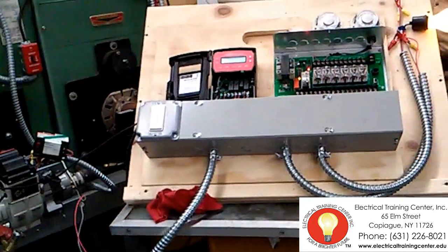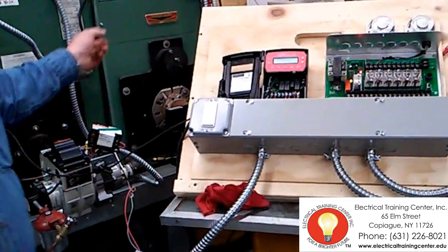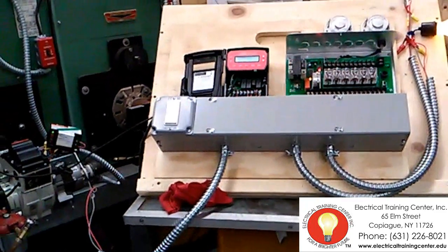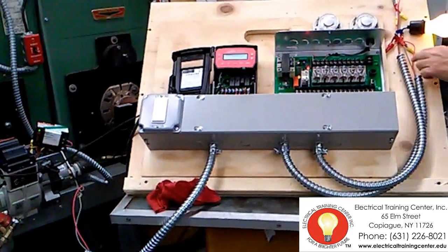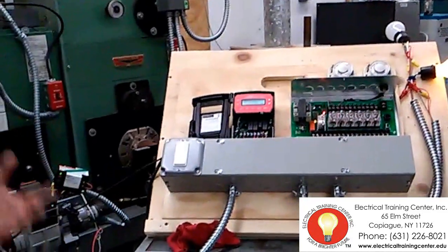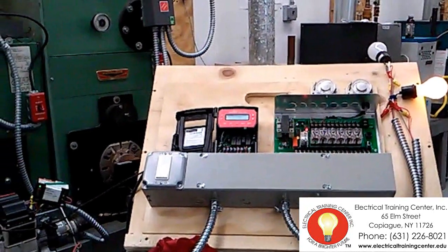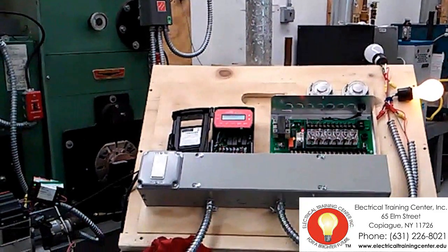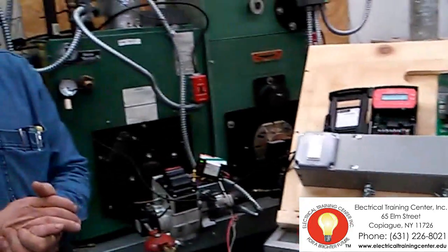We chose zone one, and that would be zone two as well. You're also hearing this burner firing again — because if you're imagining, the circulator is on. We're now taking that hot water that we made out of the boiler and circulating it around the house. What comes back from throughout the house to the return side of the boiler is cooler temperature water, because that water we've taken out of the boiler has done what it's supposed to do: it's given up its heat through baseboard radiators, convectors, radiant, or aqua coils that may be in a warm air system.